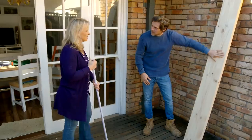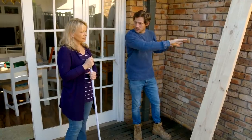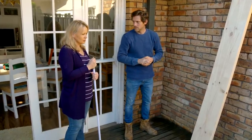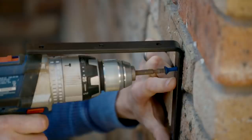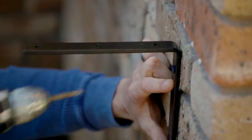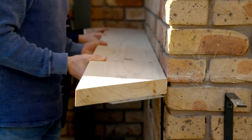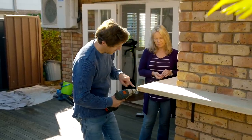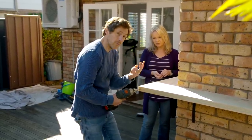I've been busy sanding. Nice smooth timber. I'm thinking we're going to have a bar outside the kitchen window, like a servery, and then it's going to wrap around here — loads of room for a table and chairs, but when you're entertaining a lot of guests, you've got extra space. First things first, though, we've got to get these brackets on the wall. If you're working with a mitered corner like this, it's a good idea to drill through this way, and that holds it together before you screw from the underside.